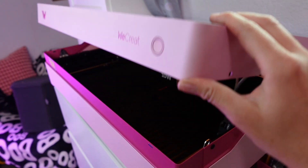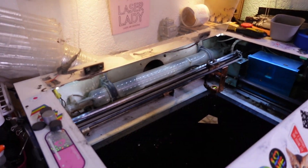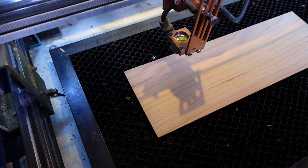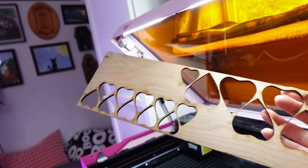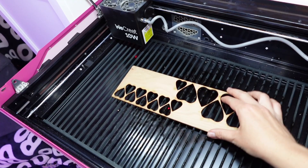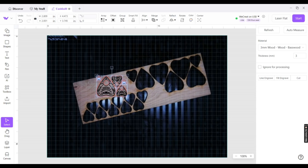Let's start this battle with something I make and sell often. These Ouija board planchettes are made of solid cherry wood and are highly detailed. The 40-watt needs manual placement of the wood as well as manual focusing of the laser head. Once I make sure the parameters are within the wood and the laser program is all set, I push that one through and it gets cooking. The We Create Vista has a super awesome feature that my other laser doesn't have, and that's a camera. I can put in the wood all willy-nilly and the Make It program will take a picture of the laser bed and allow me to fit in the design wherever I like.